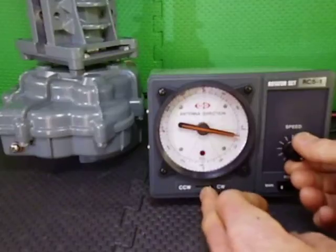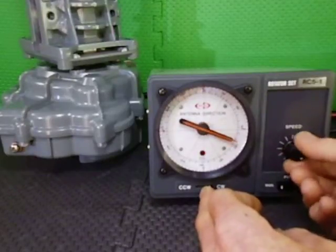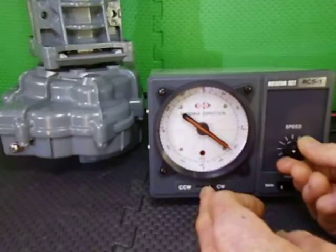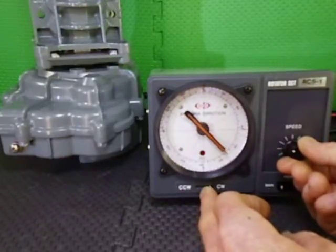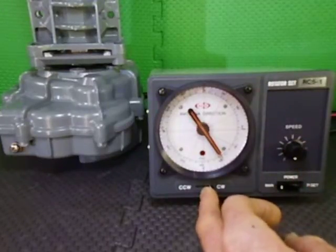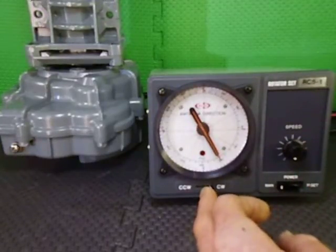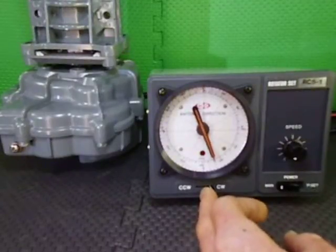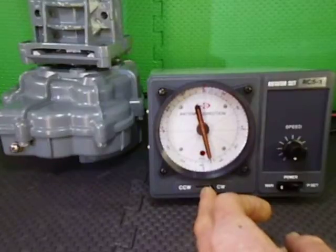So back around the other side, just past east — we can ramp the speed back down again as we come back down around the south, and then slow it down even more as we come back around here, just puttering along, making for that nice accurate honing on our bearing.